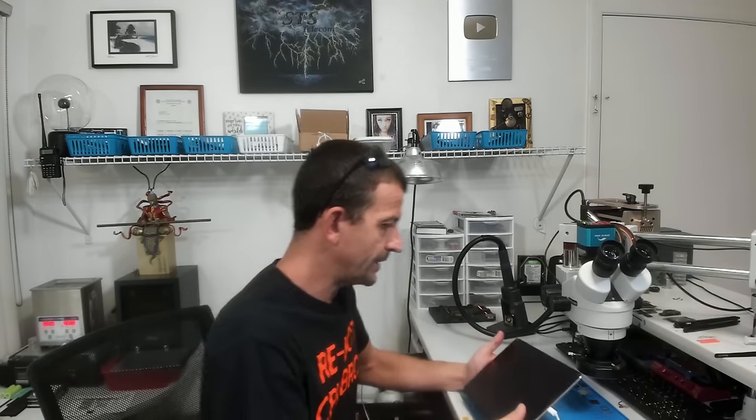Before I did this repair, as I said, if you did a slide to power off, as soon as it turned off, it would turn right back on. And that is even without the charger connected. If you just took the DC power supply and hooked the board only on the table, hooked the power up to the battery terminals, this board would instantly begin booting.